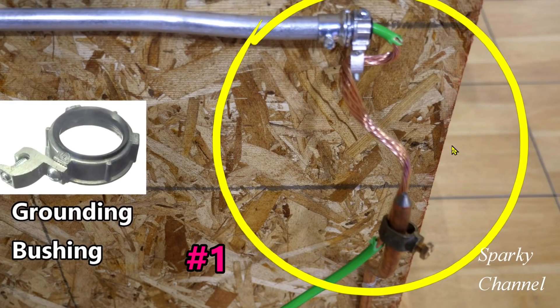Here's our first example. We have the EMT fitting secured well, and the grounding bushing is right here. This contestant stripped the entire area of wire here — the strip going all the way from there down to here. He's got the acorn clamp clamped well to the GEC. This is completely incorrect about the grounding rod — this pointed portion is supposed to go in the ground, but that's not the contestant's fault, so don't count them out for that.